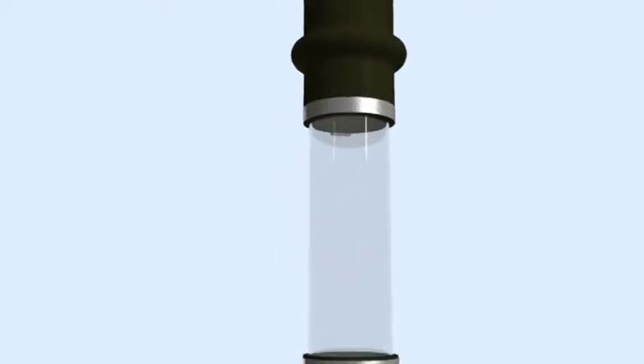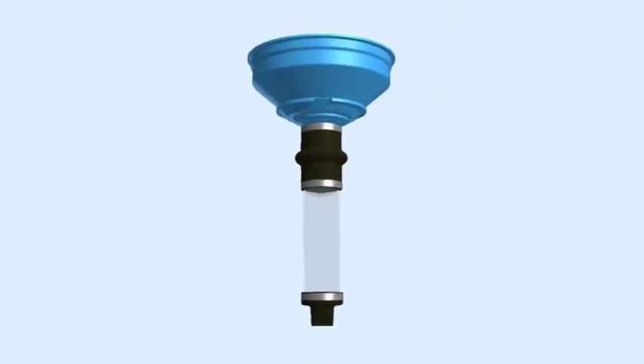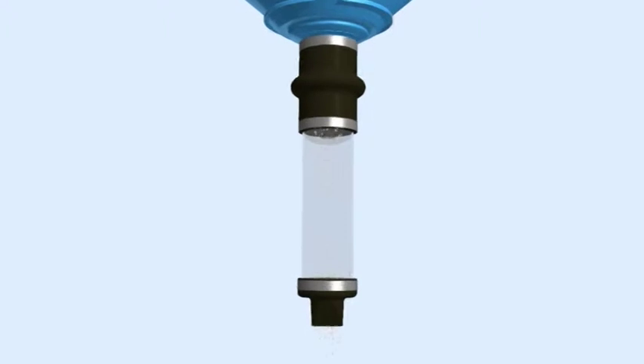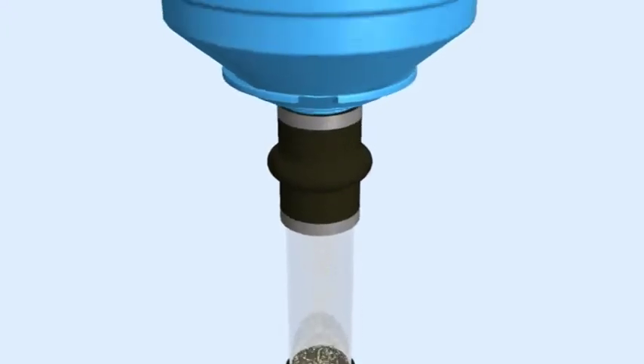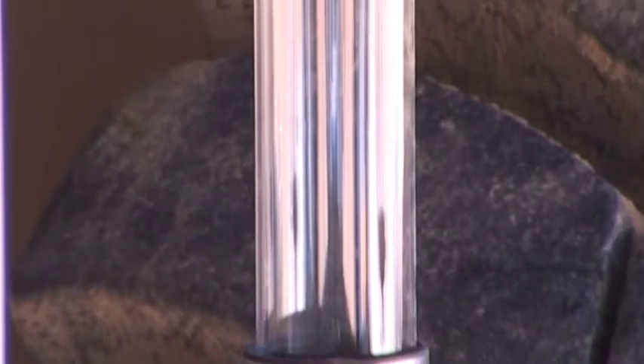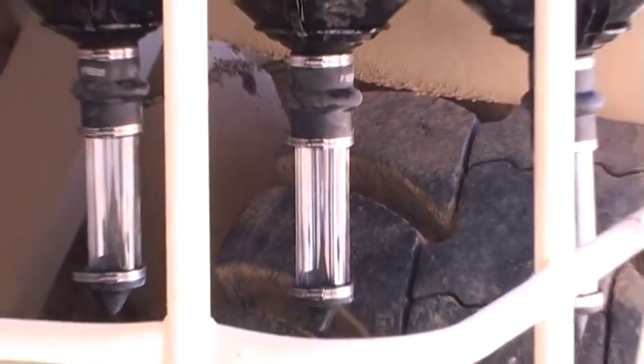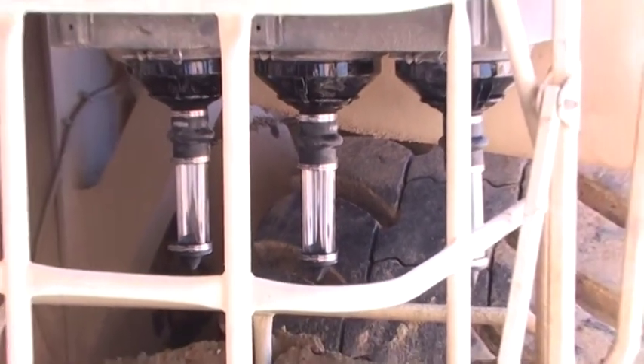The optional Donaldson dust dumpa tube extension is available for the SSG. The dust dumpa's rubber connector vibrates during vehicle operation when installed on dust cups on the lower assembly. With the assistance of gravity, this provides improved evacuation of pre-cleaned dust from the air cleaner. The dust dumpa's transparency allows visual dust collection inspection instead of the less safe manual checking of the dust cups.